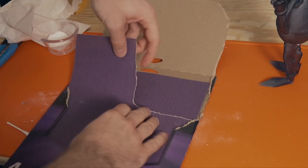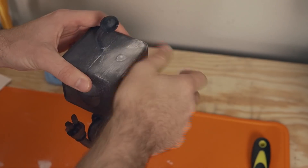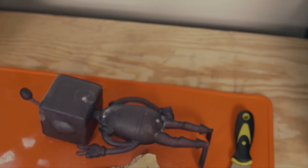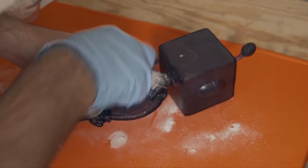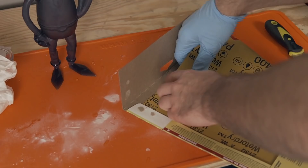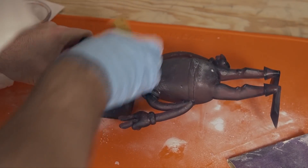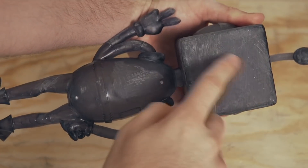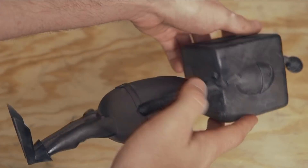Once that was done, I grabbed some sandpaper. I had 150 grit, which I initially used to sand away the super glue and baking soda that went where it wasn't supposed to. I will say right away that I am not a big post-processing person, but post-processing resin prints is a hell of a lot easier — this stuff sands so much nicer than any FDM print I've ever attempted. Once done with 150 grit, I took some 400 grit sandpaper and went over everything to try to remove as many support pegs as possible. If I had even finer sandpaper I would have used it to clear up some scratches, but since I'm going to prime and paint, I wasn't super concerned.